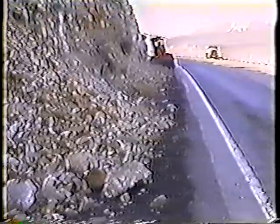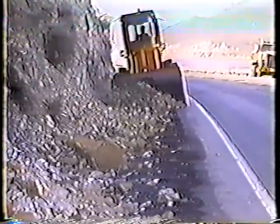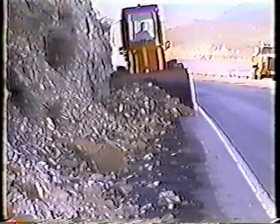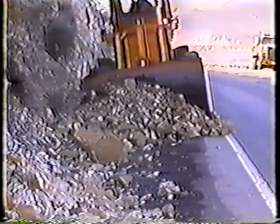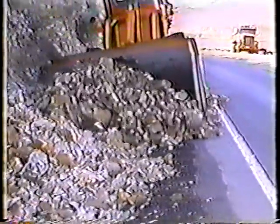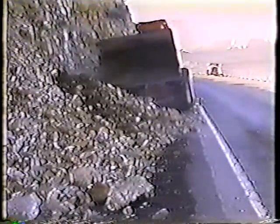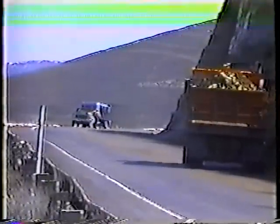So let's take a look at the procedures. If the back slope gets undercut, there's a good chance it will cause a slide — and that's the last thing you need. So when you pile up the material, travel along the ditch working toward the slope. That way you can see the back slope better after each pass. This same procedure allows you to get a good idea of the ditch's original grade and slope. As a general rule, you'll end up with a good foreslope if you place the bucket just on the edge of the pavement as you move the material along. There's not a whole lot of room to work — and that's always the case with removing slides. So even with all the traffic control devices in place, you still need to watch out for traffic 100% of the time. You never know when someone's going to run a flagger's stop sign.